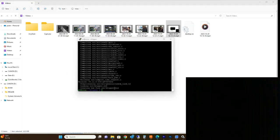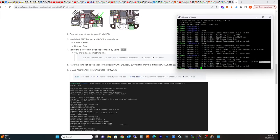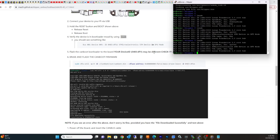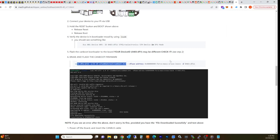Now that it's done compiling, I need to figure out how to flash it. All these boards are different — on the newer 1.2 board it's a key combination to get into bootloader mode. I found a page on how to flash this newer 1.2 version. Make sure it's on the bus so you can confirm it's in the right mode. If you don't see DFU mode you have to redo the sequence until you do. I'm going to copy the flash command into a text document so I don't mess it up.